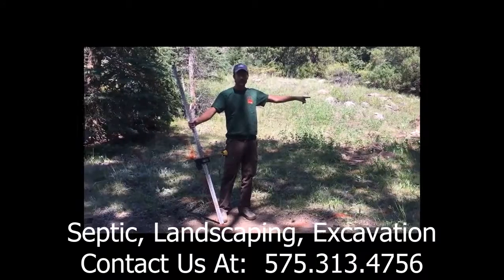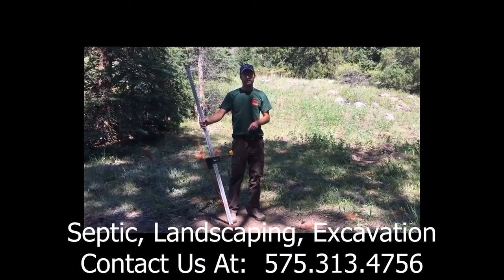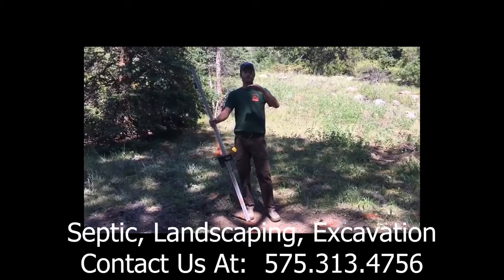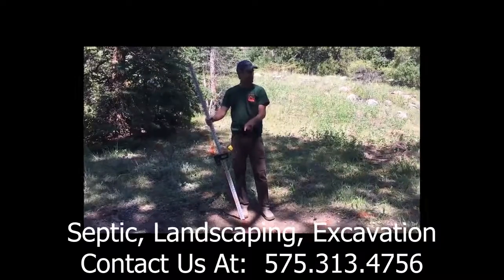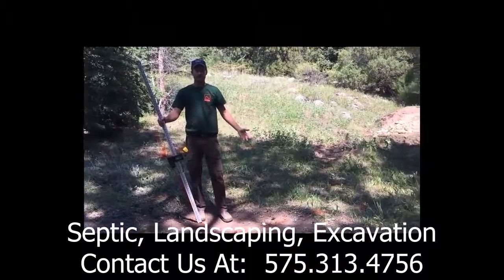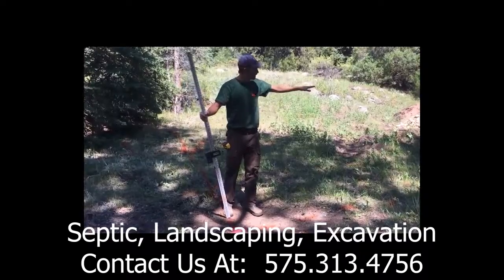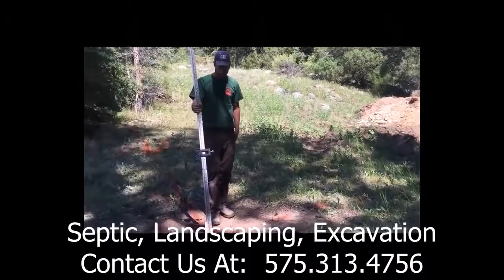We want to pick the location for our two downhill corners on the long end to be perfectly level with one another, because that water, if we ever do have a failure, is basically going to spill out through the lowest point. So if this corner is lower than that corner, all the water would spill out here in the event of a backup or something going wrong with our leach field. We want these two corners level so that water would be contained within this lower lip of the pool.